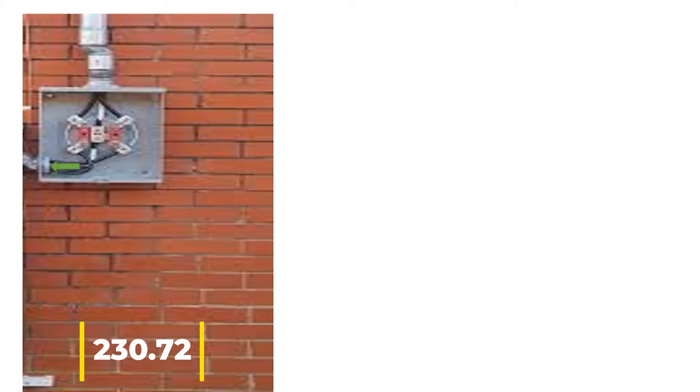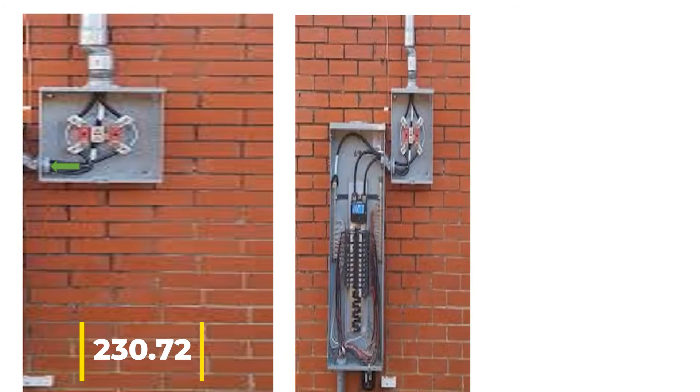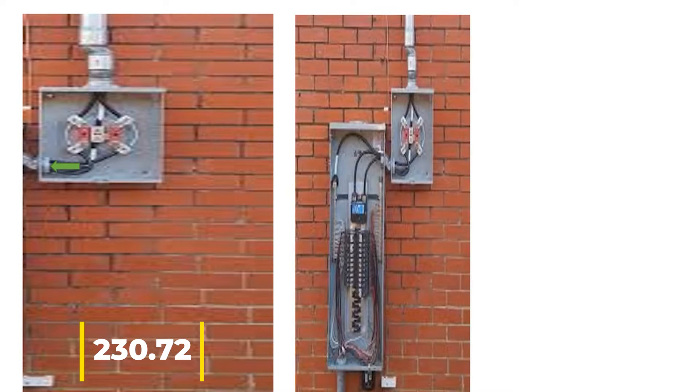Let's say it makes sense to pop out of the left-hand side first, and the way this house is set up it makes sense to have an outdoor panel — Panel One. We're putting that outside, coming straight from the meter base, and this is going to be Service Disconnect One. You're allowed to have up to six service disconnects on a structure, but that's a lesson for another day. In this case we're just going to have two 200 amp disconnects, and technically they're both service disconnects.